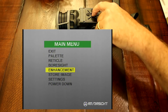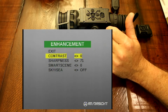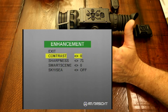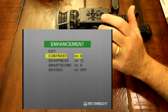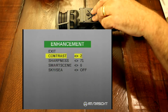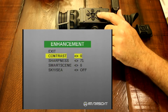Next down the menu is your enhancement menu, and this is new for the ProLine and it's very awesome. What we have here is contrast — your default contrast is zero. They call it active contrast enhancement, and you have values from negative eight to positive eight. The negative or lower values will make hotter objects stand out more, while the positive values will make cooler objects have more contrast. So you can really tune that in to whatever your particular environment is and make your targets really pop out.